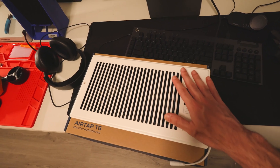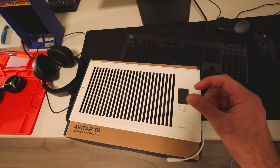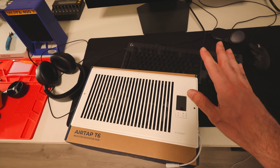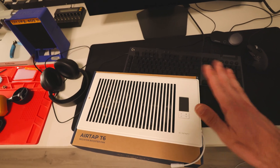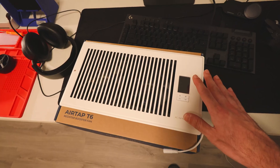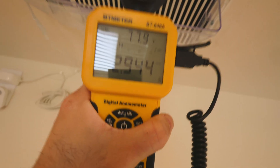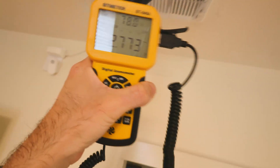So now let's go take a look at the wind speed measurement when it's turned on, and then I'll show you the data from this room using those thermometers I built in the previous video — comparing how much colder this room gets with the booster on versus off, on two back-to-back days with identical outdoor temperature profiles. Now the booster is on, and we can see immediately the difference: we're hitting almost three meters per second. I've also added a deflection guard so the air blows inside the room.